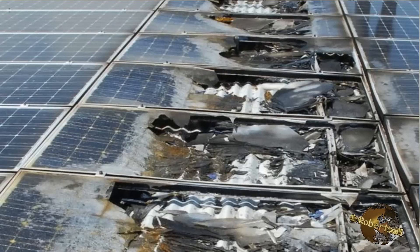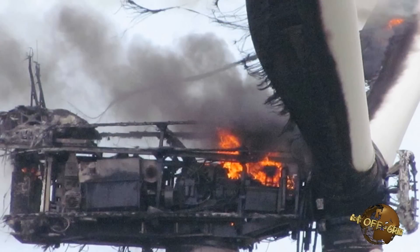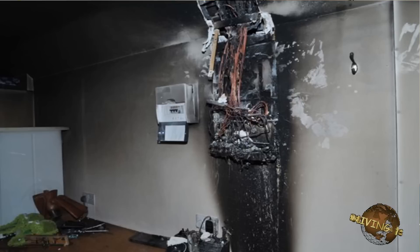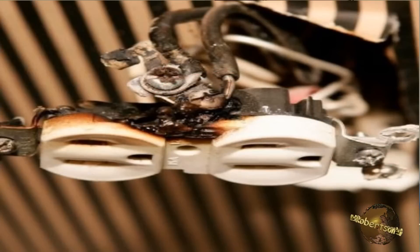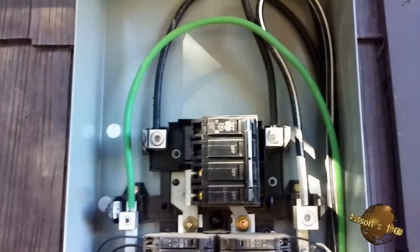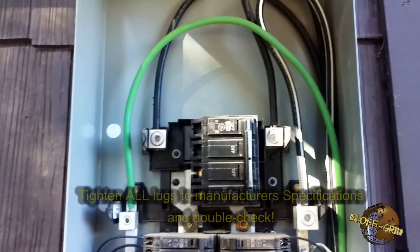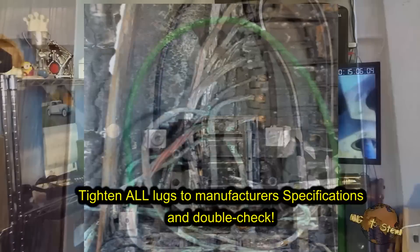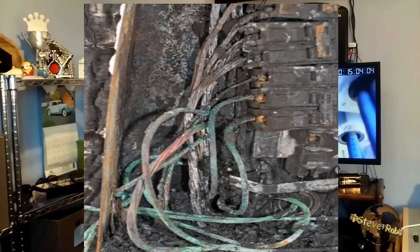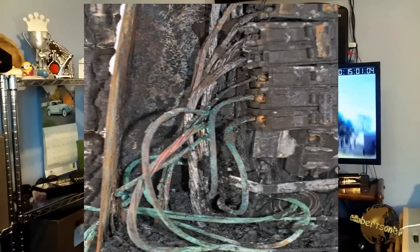There have already been a lot of fires in this country and around the world involving PV panels, solar panels, wind turbines, and just plain bad wiring. One thing I'll really stress: when you wire up any system, really crank those wires down tight in those lugs — whether it's a breaker or a termination lug on a neutral or a ground bus bar. Tighten those down really well, because a loose connection is an arcing connection, and an arcing connection means fire.